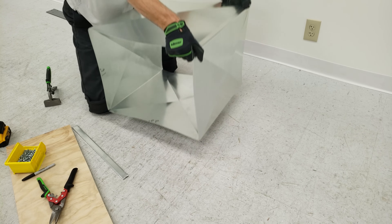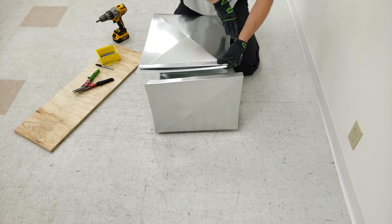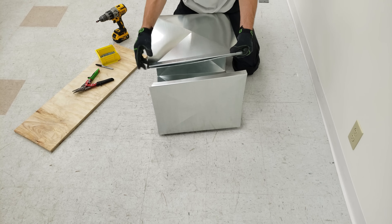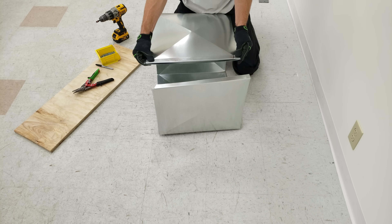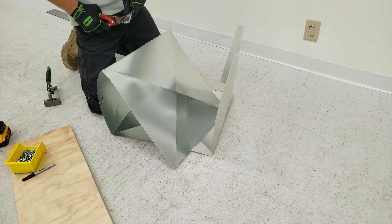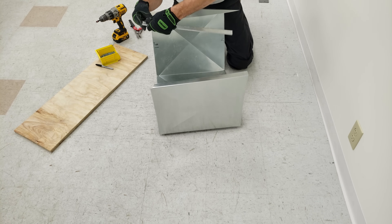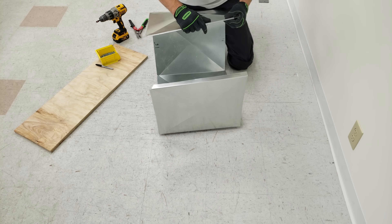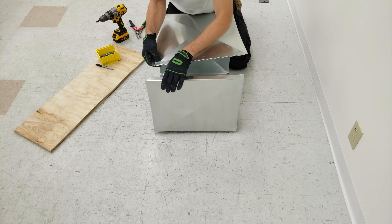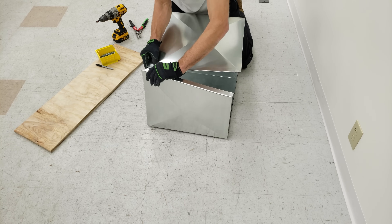We don't want to just screw it — we want to put our s-lock in. Basically we're going to be putting our slide on the top for the end cap, and we want to have this start at about half inch from the end because we're going to be folding this upwards. I have my mark right here so that we have about an inch and a quarter up here — one inch for our s-lock — and we're putting our end cap in.